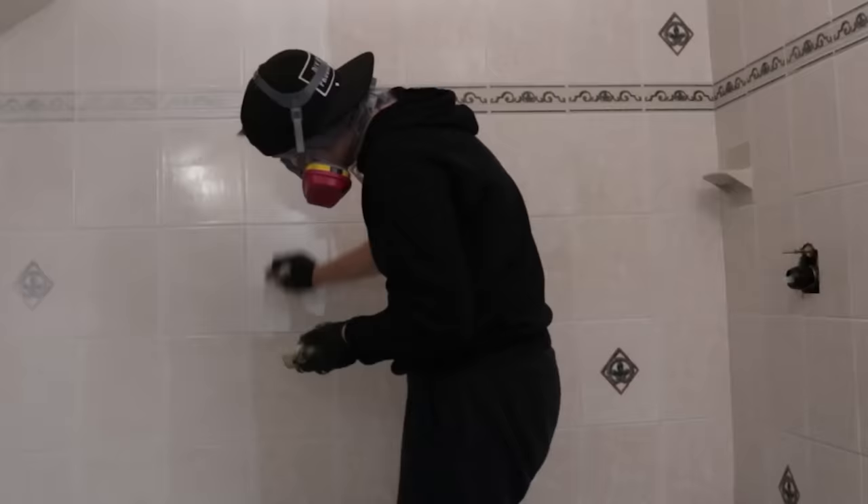I was trying to figure out the best way to create the lines for this. When you're working with water getting into crevices and you're DIYing it, there's always room for error. I'm using an oil-based spray paint, so it will work in a wet situation. However, I'm only putting the spray paint on the outside. I was worried it was going to scrape off glass very easily because spray paint normally doesn't adhere to glass well. So I called Rust-Oleum, and they confirmed: yes, use the etching cream on the glass. I put my mask on and did some etching cream to prepare the surface for spray painting.